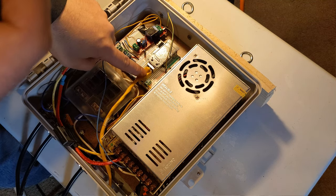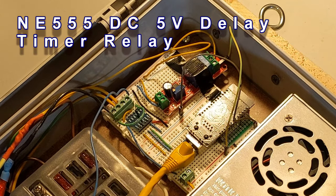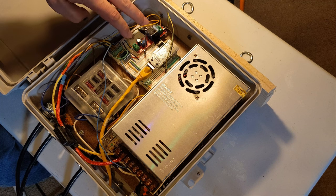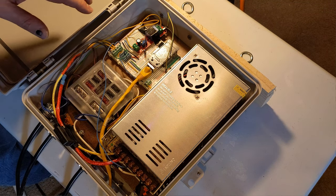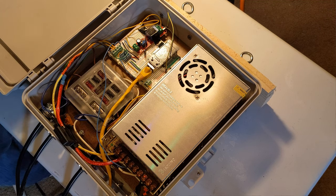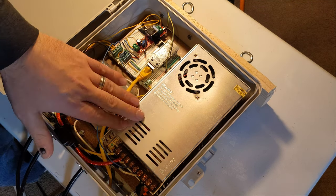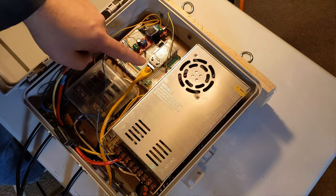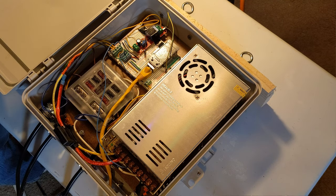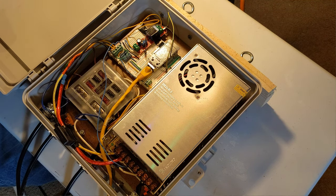One unique thing about my show is this component here — an NE555 5-volt delay timer relay switch. Essentially, as soon as the power supply turns on, the power goes to this delay switch and the timer kicks off. It doesn't automatically power the controller directly — it waits about 8 seconds and then turns on the power to the supply. When I first hooked it directly to the power supply, I found that periodically it would not turn on; the voltage would slowly gauge up to 5 volts and that wasn't ideal for the actual controller. So I purchased a pack of 6 of these, which allowed the power supply to warm up — I set the timer to 8 seconds before it would allow the power to go through — and once I put that on, it worked every time.